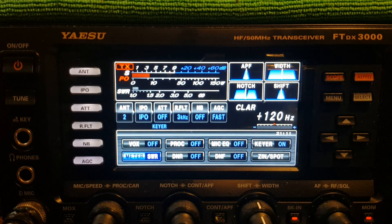One point one five to one point two to one. No tuner needed — internal or external. Your feed line run to the unun way out there: SWR 1.15 to 1.2:1 — as minimal as they can possibly get. I just don't see why people resist adding an extra tap or two to their unun.